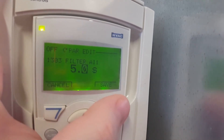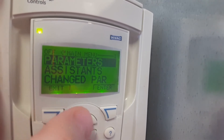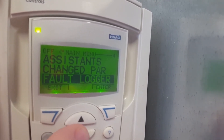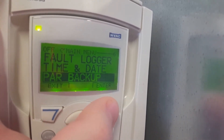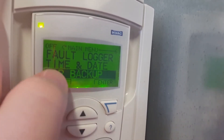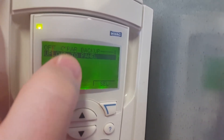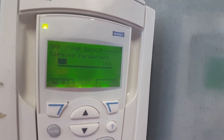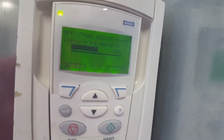Now that I've put that value in, I hit the save button and also hit exit. One thing I always like to do any time I make parameter changes is back up the parameters. Scroll down to parameter backup — you may want to check out my video on how to back up the parameters on these drives. Hit enter, upload to panel, and you can see there are no previous backups, so it's really good that we do this. If something happens to your drive and you need to change it out, having a copy of those parameters makes setup of a new drive much faster.